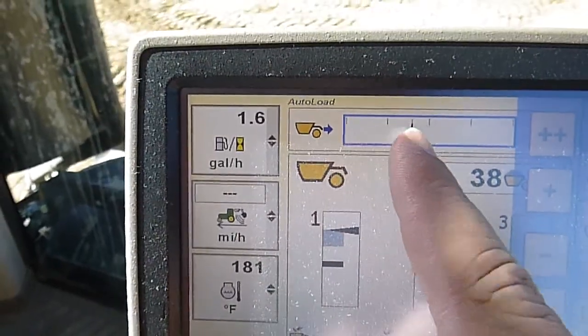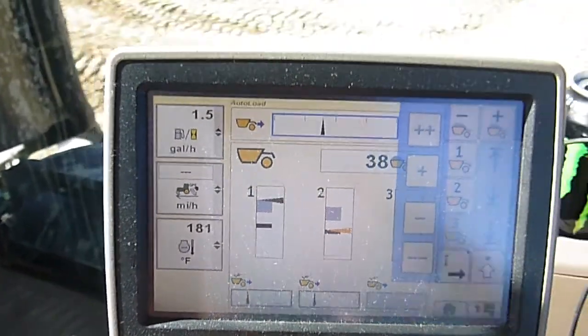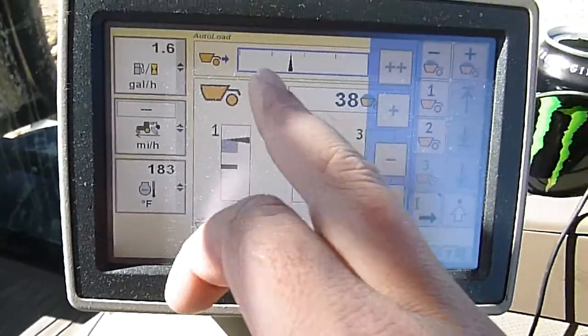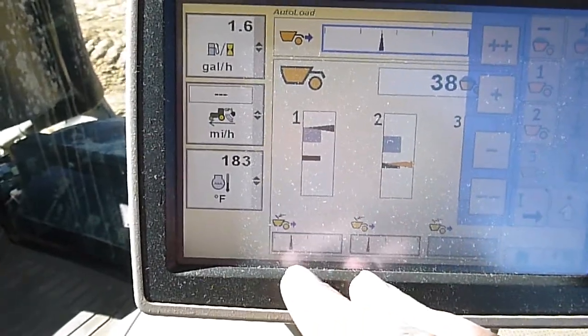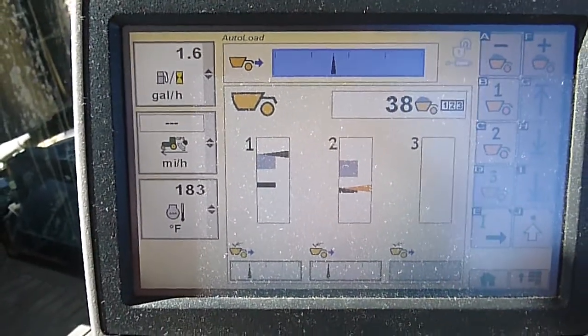These bars here adjust the aggressiveness of your cut. When you're starting your cut, it'll adjust how fast and hard your cutting edge dives into the ground when you set it down. This is an average draft — there's your front can and back can. You can fine tune them and adjust how much your edge is diving into the ground when you're getting your cut started.